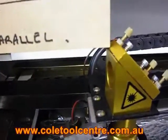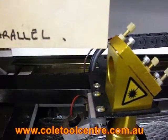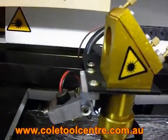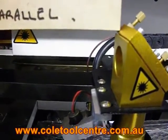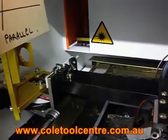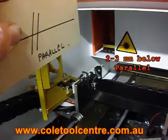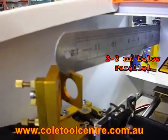The ideal position of the laser head, as you can see, is about two to three millimeters off that top surface, which is about the same height as our target. So two to three millimeters — when it is parallel, our laser head should be down about two to three millimeters. All the other mirrors — the mirror here, between the target area of that mirror and the back mirror — should all be parallel for the setting of the second mirror.